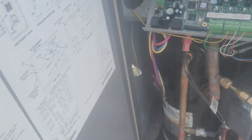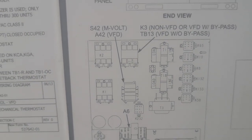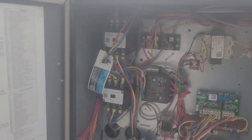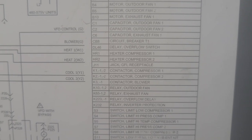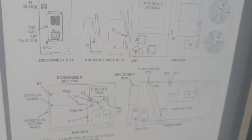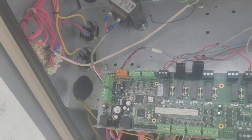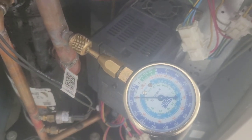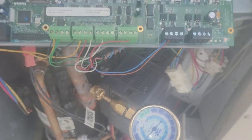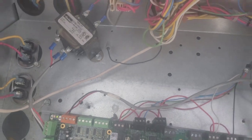So back to this now. This is the compressor that was froze up — this is compressor circuit number two. I'm gonna look on here and the contact is in the top left corner of the box, so that's gonna be K1 and K2. I'm gonna find those up here. K2 is for compressor two, which is the top one. Let's test that and make sure it works — yep, that's the one.